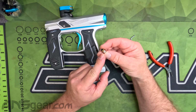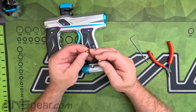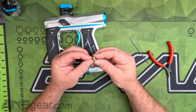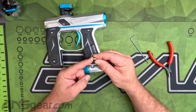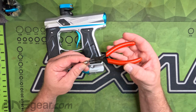If the pressure that you are adjusting here, if you start to turn it up too high, it will overcome this spring pressure right here. So this spring can only push so hard, and it's pushing this brass piece forward and sealing it against there. But if the pressure coming against it from this side is stronger than the spring, then this cap will open, or it'll get the pressure, I should say. It's not going to open. The pressure will push the cap back, no longer sealing, and the pressure will escape out the side. And that's how this is designed. That's why there's holes in it, to purge pressure if you've turned it up too high.